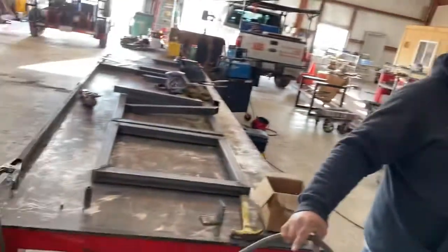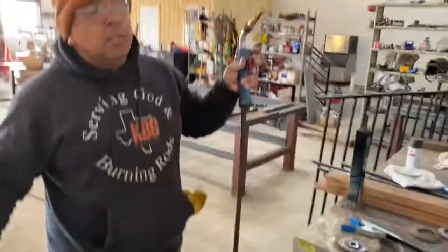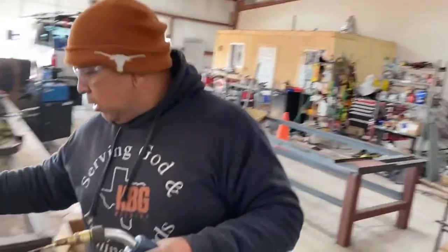It's called jog — on the setting there, see where it says 'setting'? It says jog on the screen. That means just push and then pull the trigger until the wire comes out. Stay exposed, then put your tip back on.